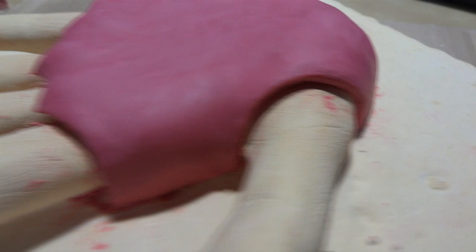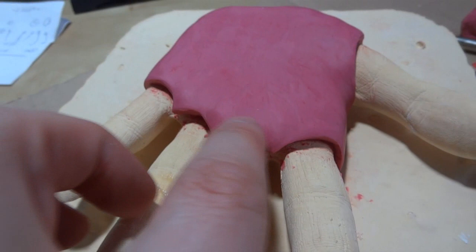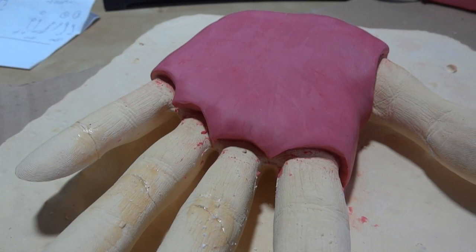That's what I've done around the fingers and the thumb — there's a nice edge. When this is a plastic part I'll be able to sand those back with a drum sander, so I'm not quite sure how restrictive that's going to be on movement, but I'll be able to cut those back. For now I'm going to make them as tight as possible, because obviously I can cut off what I have but I can't add some back on later. In clay I can, but when I've made a cast that's a rigid part I won't be able to.